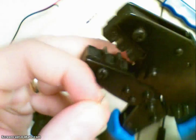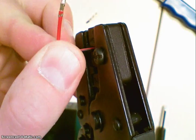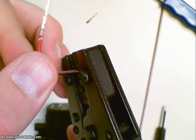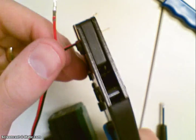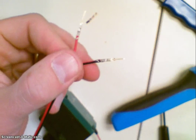There's one pin. We'll do the second one. Hanson Hobbies has a great video — the guy in that video is very good at doing this, very fast. I think he can replace an entire servo with three of these in less than a minute, which is pretty phenomenal. This is only about the third one I've done. When I'm crimping, I usually don't squeeze it all the way down — you don't have to cram it down. There you can see the pins are good right there.